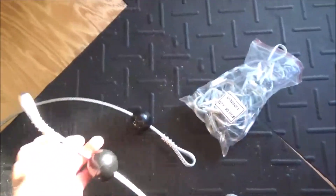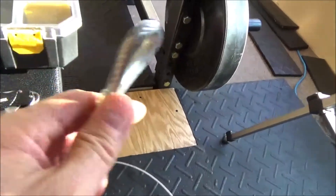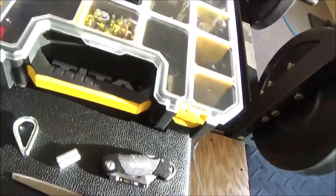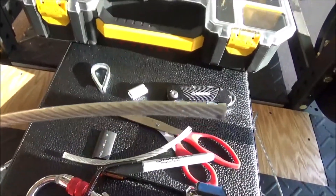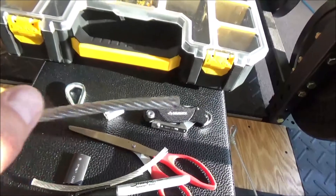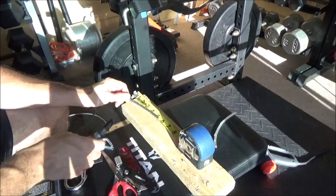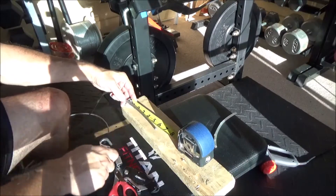The very first one I did before I was shrink wrapping it — you can see this is the crimped swage on the end. It's not sharp or anything, but I like the idea of putting some shrink wrap on it. To get an end that you can hook things on to, it starts with stripping off the plastic coating. Bare wire rope can cut you sort of like a saw, so the plastic coating is smoother, but you can't do any swaging with the plastic coating on. I need to strip off a little more than 6 and a half inches — maybe 6 and 5/8 inches — then mark it and cut it.